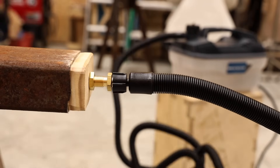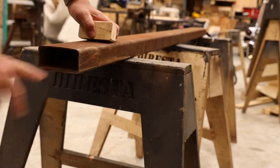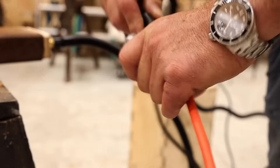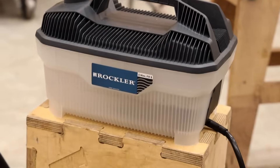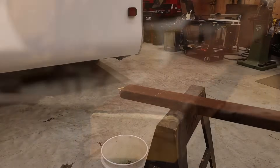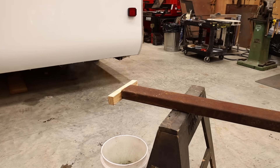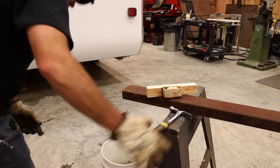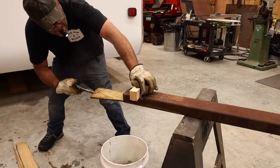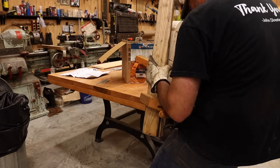I just plug the end of the tube and fill the tube with the wood I need. We're doing four layers. If you notice how thick that wood was, it steamed up and got a little stuck inside there — it had a little struggle. So now here it is maybe about an hour later. You're supposed to do the steam bending for one hour for every one inch of thickness, and so that was about one inch thick of wood. What was interesting is it steamed open to the width of the inside of my thing, so I had to be more cautious with the next batch.